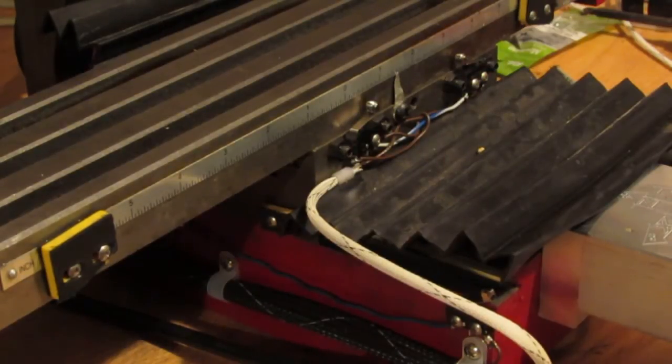Okay, it went, by the way, it moved in a direction opposite that I thought it was, but it doesn't matter. It moved a half inch, okay? I told it to go an inch, it moved only a half inch. And that immediately, with experience, tells me that the steps per is set up wrong. And so we're going to go back to this.